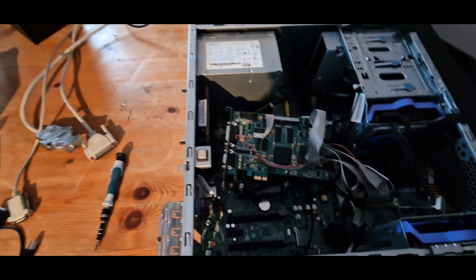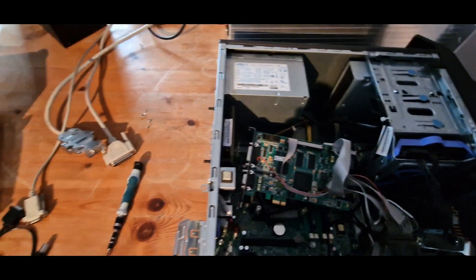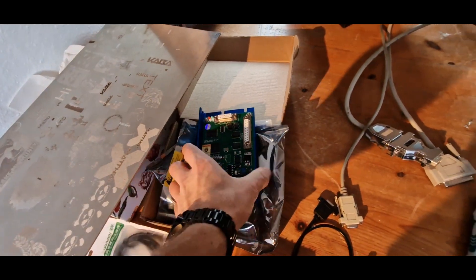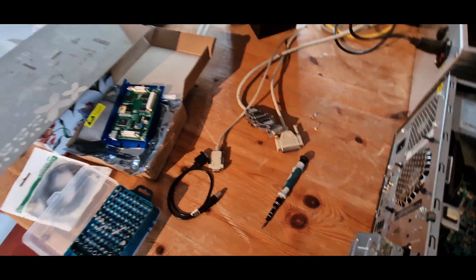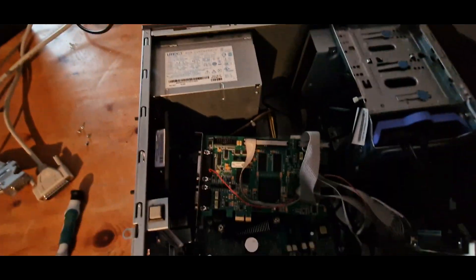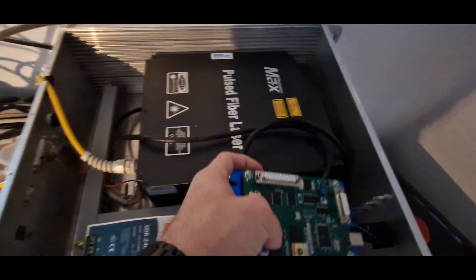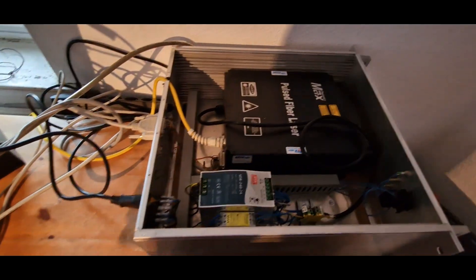The connection is not via USB or something, and the protocol this thing uses is quite proprietary. So what I did was order one of these driver cards which can be used with EasyCad or LightBurn, which is a paid model for such lasers or engravers. The goal is to remove this PC and the PCI Express card and install this new EasyCad driver board somewhere in the case.